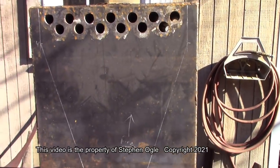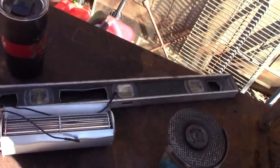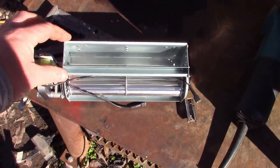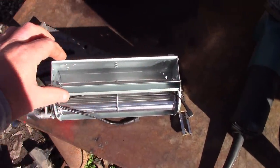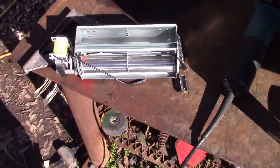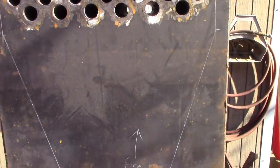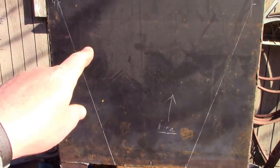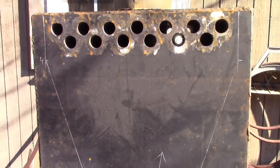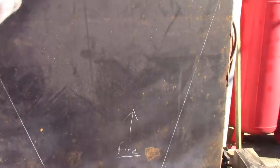All right, here is the plan for my blower. This is my blower right here. It's two inches wide, so the opening needs to be two inches wide where it goes in, and it's seven and a half inches across. What I've done here is I've just laid out some marks — this is going to be the shape of my air channel. I'm going to have two-inch-wide strips that just follow these lines all the way around.